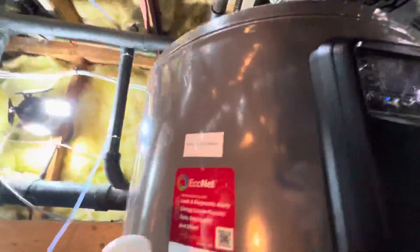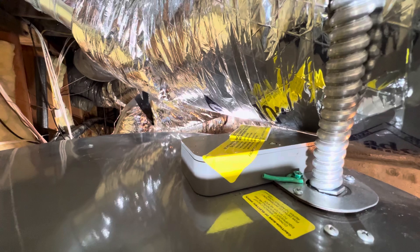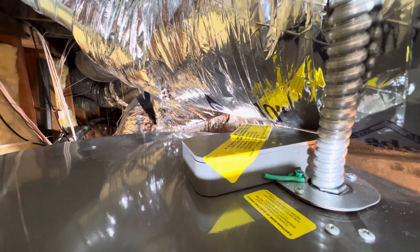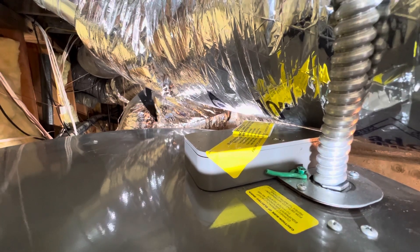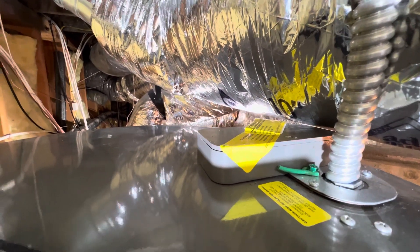On the top there's a CTA item, which we're not using — that's for the utility companies to be able to monitor and control usage. So if I wanted to use the water heater at 10 in the morning, I might be out of luck because they don't give me power. You could Google 'CTA on water heaters' to figure out if you want to use that or not, but it's pretty restrictive.